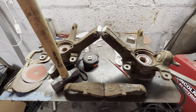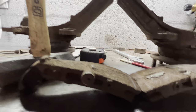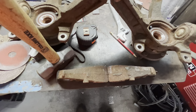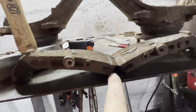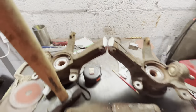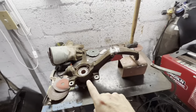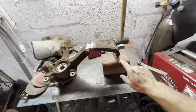After about an hour or so of grinding and getting these things all good, I got them ground and fairly even. Next up I just got to clean off the residual stuff on the outside, so I'm going to use a sanding pad, and on the inside groove that's hard to get to, either a Dremel or a cutoff wheel - just kind of stick it in there and clean it.